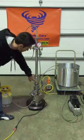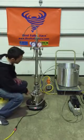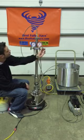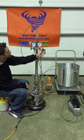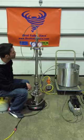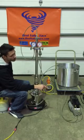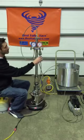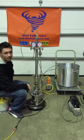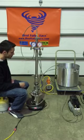You can actually see a flow right now — it's flowing down the sides. As the heat builds up it helps vaporize the solvent. We'll toggle this valve to get to the right pressure. You'll also hear the tone of the pump change once we really get the solvent going. What this valve is doing is acting as back pressure on the pump since there's no valve on that recovery pump itself. Without back pressure, if you throttle it wide open, it's hard to get a consistent flow. When your pressures get close together at the same reading, it gives you a pretty nice flow.